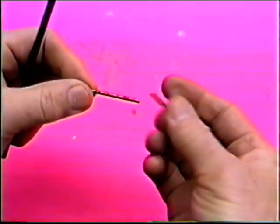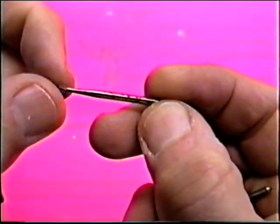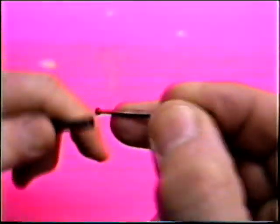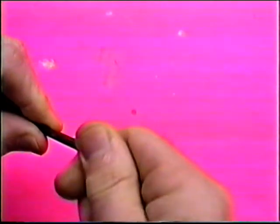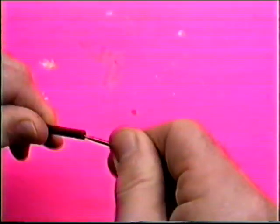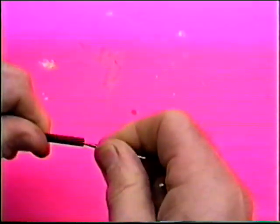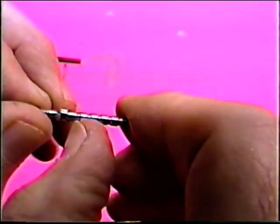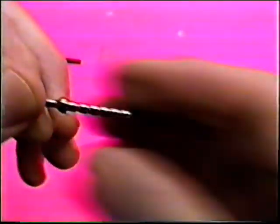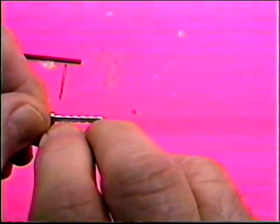One thing I have some experience in is secondary bonding to carbon fiber parts. This is a 3/32, an eighth one is too big, but see the shape of the burr? You could actually do it by hand, but it's just as easy, so I put it in a battery powered drill. I need to get that good and rough, good and scuffed up. Rougher the better. And the same thing we want to do with this, even though it's got little barbs, making it rough is definitely going to make for a better bond. We want teeth. What we want is not a smooth piece that can just pull out or fracture, but teeth. As many teeth as we can get in here.